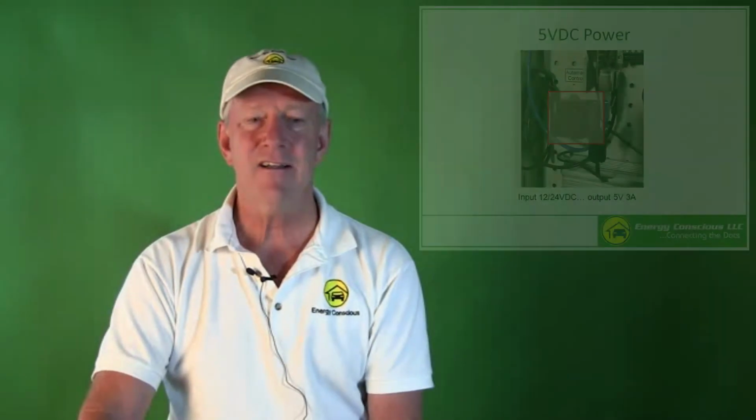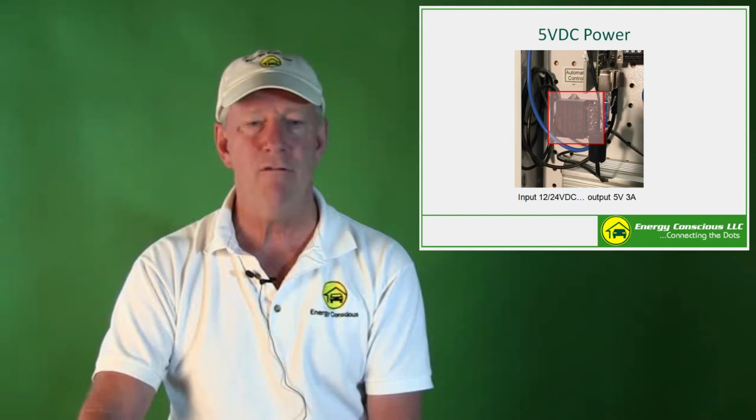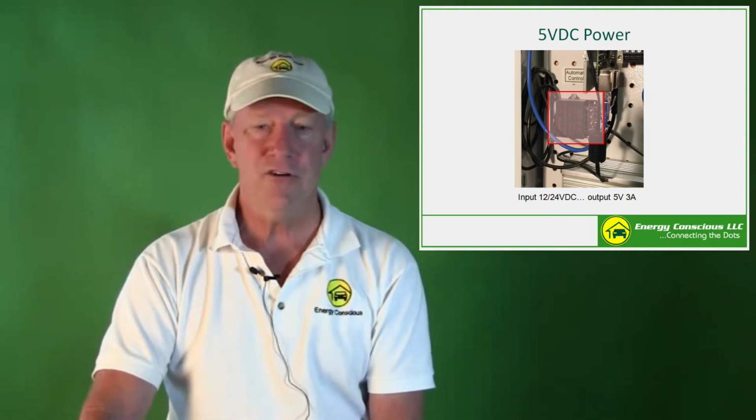So now all we need is the Raspberry Pi power. Recall that the whole reason for moving to the LumenCache architecture was so that we could use the solar DC directly, no converting it back and forth to AC. So there was no way we were going to put a surge protector and a wall wart in our structured wiring panel. Luckily, more checking on Amazon allowed us to find a 12 to 5 volt DC converter. No surge or wall wart.